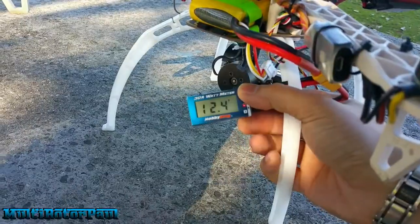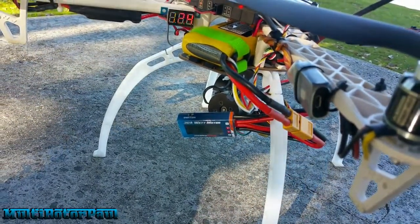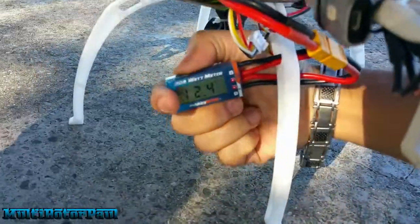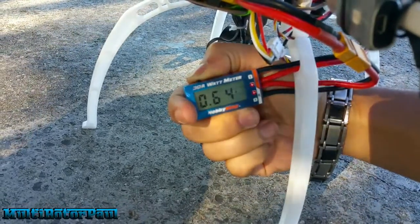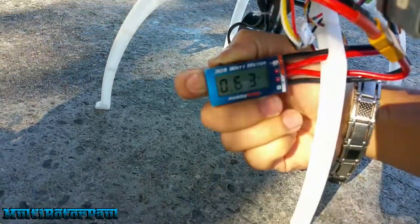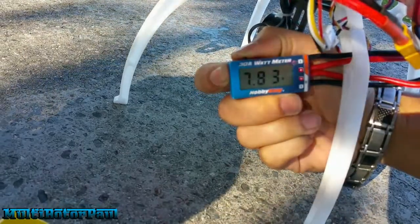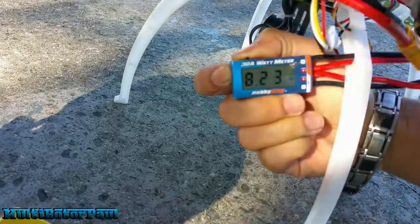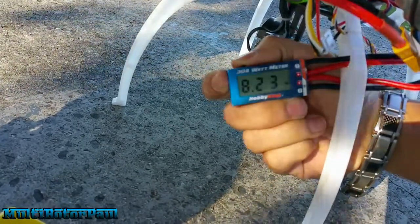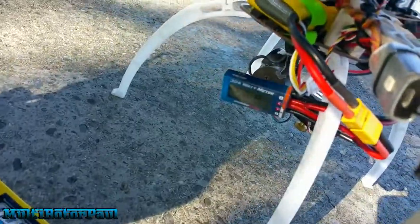The reason why I wanted to get this watt meter is because I wanted to see how much power this quad is using during flight. I'm going to do a quick hover, maybe 30 seconds to a minute. This actually has a button on it — press that and you can see how many amps it's currently pulling. Right now it's pulling 0.63 amps just sitting there. Press it again and you get how many watts it's using — 7.83 watts right now, 7.95. That's the watts peak — the maximum watts used since connected — 8.23 watts. That's the number I'm going to be looking at: how many watts and amps.